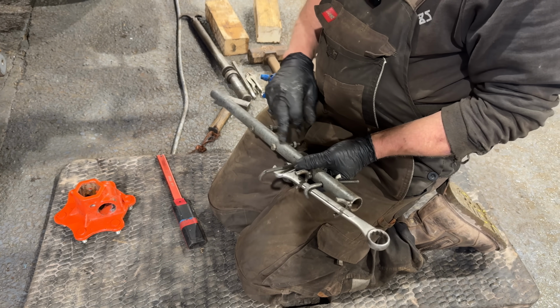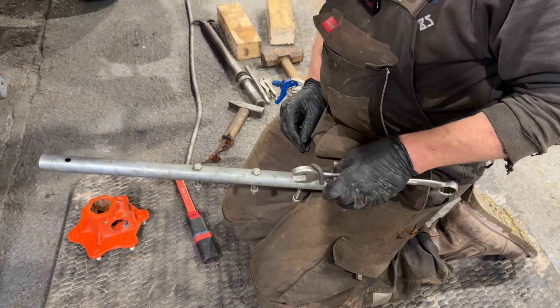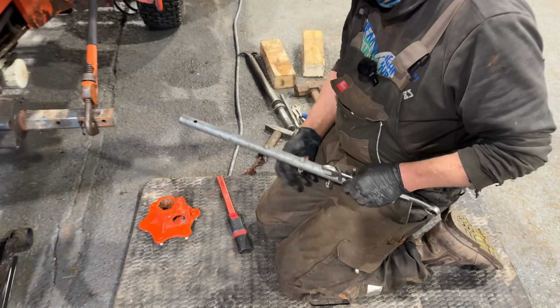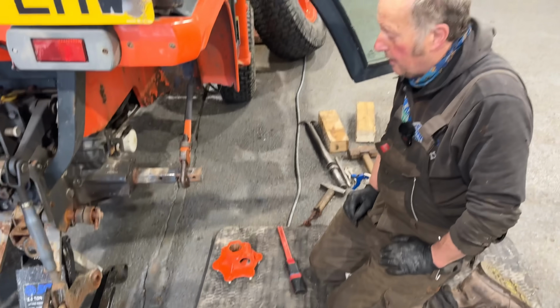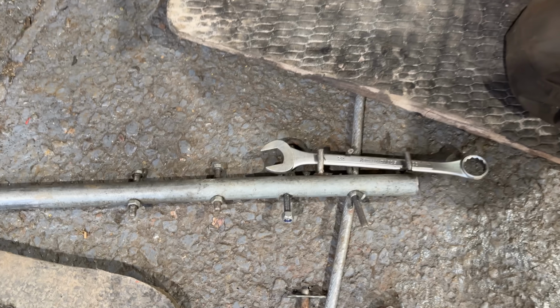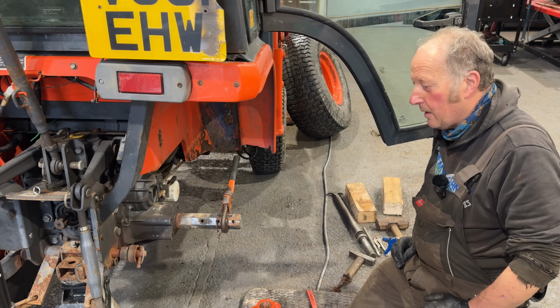And it just happens to be drilled to the diameter of the two bolts, because when you do disc mowers, the old Lely disc mowers, you pop a pin in to lock the disc. Ah, you might have to use that on our Lely mower soon then. Yeah, might do. Is that a tool you came up with yourself? It is what you call tools of necessity. In other words, nobody else is going to help you, you've got to help yourself.